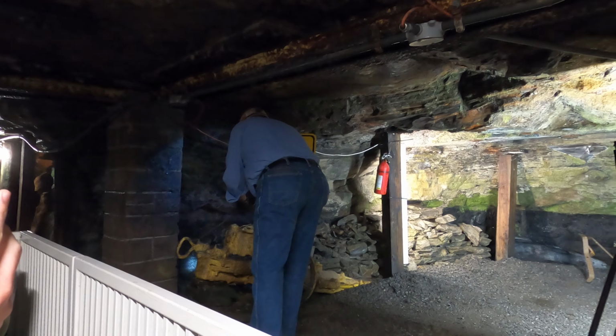Now, once you do that, you'll take your paper, pour your black powder in it, twist it into a stick, place it into the hole. Upon doing that, you'll pick up your tamping rod. This is brass to keep from causing the sparks setting the powder off. You'll tamp the powder in good and tight. Pack the hole with mud, tamp it in good and tight.